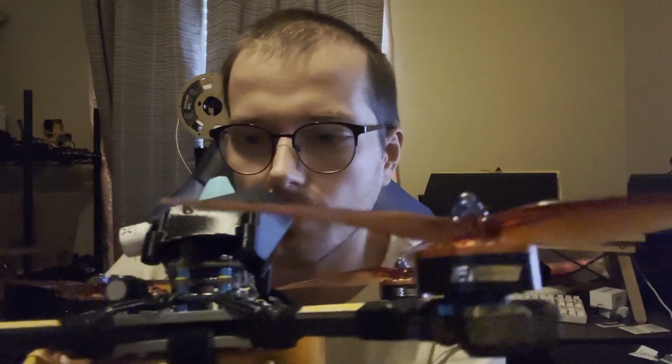All right, so let's move on to the stack. On my stack here, I'm going to open it up. On the stack, I use stack spacers. On this top plate right here, this is where my screws start for the stack, and they're very, very tiny screws, and they go to the bottom of that very first stack spacer, and then they all connect to each other from there up. I did this so that if I get hit and my stack screws get bent, hopefully they're not going to bend, or if they do, it's just going to be a clean snap and everything should be good. I'm trying to save the quality of the electronics in there by that.